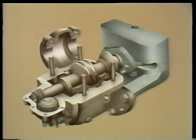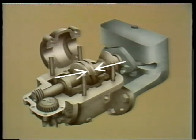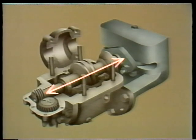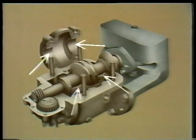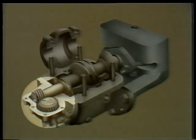Here's how a tilting pad thrust bearing works. Inside the housing and underneath the top shell is a thrust collar and two sets of pads called thrust shoes. The shoes are held in place with support brackets on either side. When there's an axial load on the shaft, the shoes pivot on their mounts, distributing the force and preventing excessive axial movement of the shaft. Since this bearing also has to handle radial loads, it's equipped with journal inserts as well. But there are no oil rings — this bearing is force-feed lubricated. An oil pump forces lubricant into the bearing, driven directly by a gear on the end of the shaft.